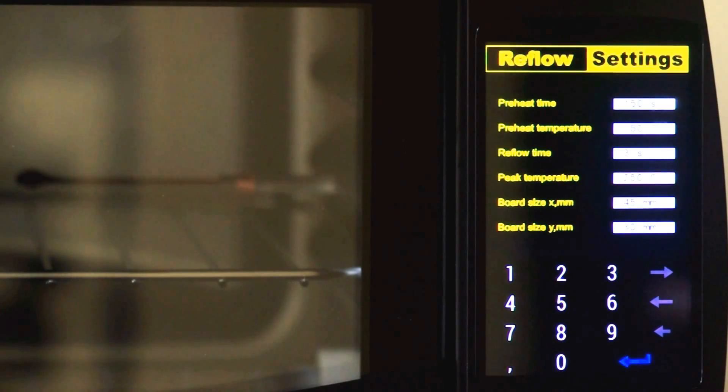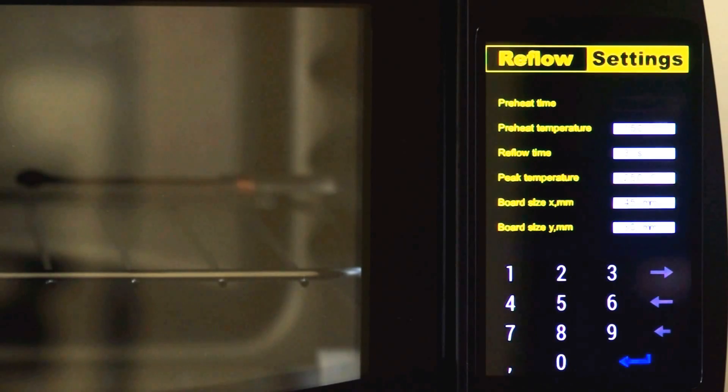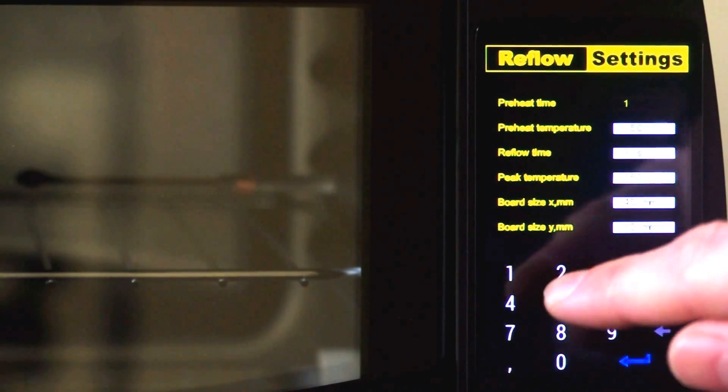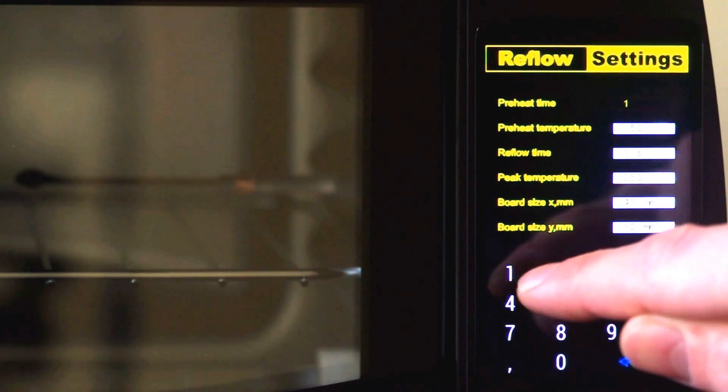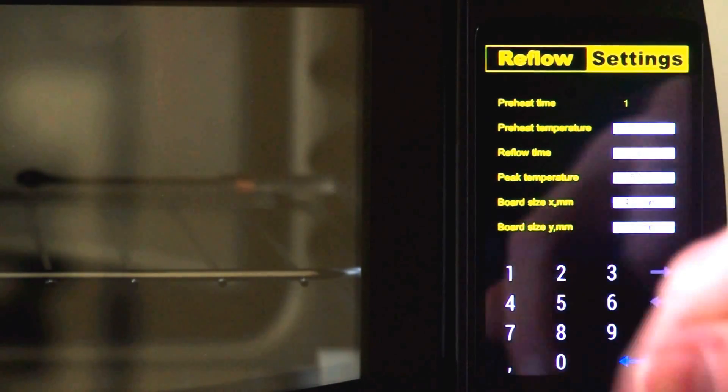There are no additional libraries used. Everything is written from the ground up. I'm writing directly to the SRAM buffer. I also don't use any real-time operating system. I simply have an RTC timer that gives me interrupts every 125 milliseconds. For example, when I press a button, I will have a bezel around it, and on the next RTC interrupt I will clear that highlight.